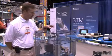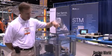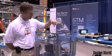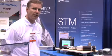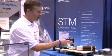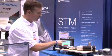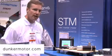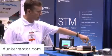This is completely contained with the motor, indexer and drive all built into the unit. This unit is a 75mm, this is a 45mm. Here we have a dual-turn motor connected via CANopen to an HMI unit, so we are able to change velocities and change direction. We are just doing touch screen. This CANopen is connected to this motor.